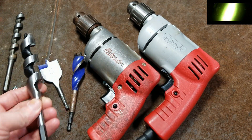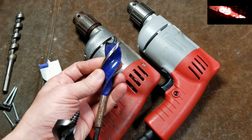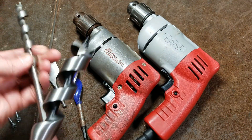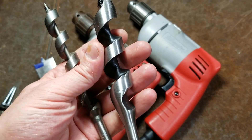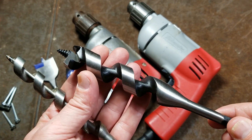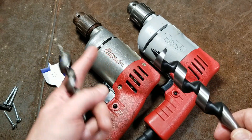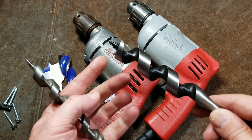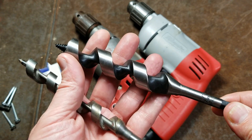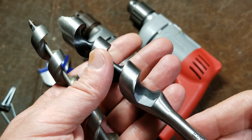Let's go drill some holes — a couple of one-inch bits, augers, a speed bore which are really tough to drive, and a one-and-a-half-inch spade bit. I'm using an Irwin. These are known as ship augers — if you really want deep straight holes with nice even walls, that's why you get augers. None of the other bits will prevent the bit from wandering as you go deep. These Brazilian new Irwins — don't buy them, find something else. You can see how this is rounded; the grinding is terrible and it's not hollow-ground.